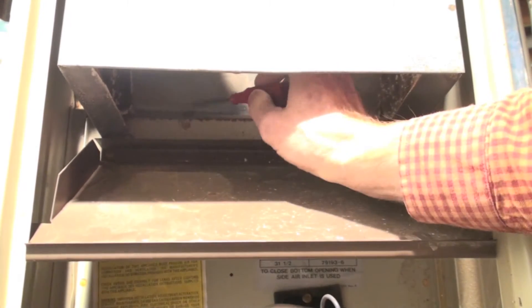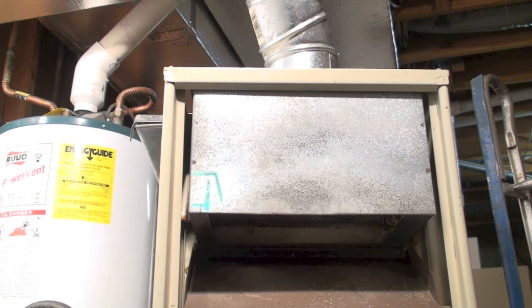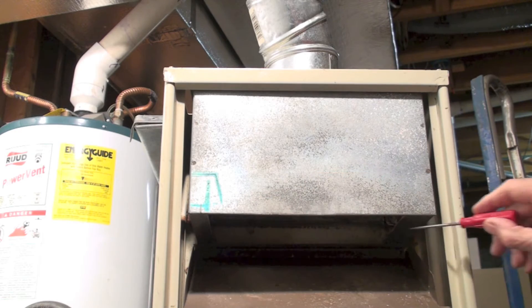The burner tubes come out right here and pass up and out that way. There's an open space between where the vent is up on top and the hot gases from the burn. The reason this draft hood is placed here is to isolate the flame from any possible draft problems with the venting. When the furnace is running, to test this draft hood you should run a flame around it.